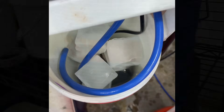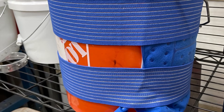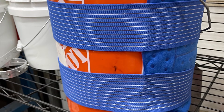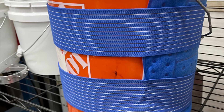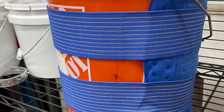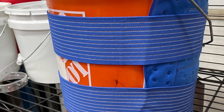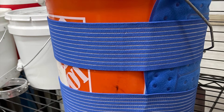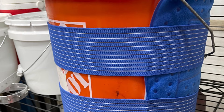Here's what I'm using to cool my anodizing bath. I didn't want to buy a titanium core chiller — they're really expensive and seemed like overkill. So I found this pad that's meant for injuries: you pump cold water through it. I wrapped it around the bucket and pump air to circulate the water inside, constantly bringing fresh acid to the side of the bucket. Even though it's plastic with poor heat conductivity, it still works really well. I have ice water in a small one-gallon cooler with a small pump, and it keeps the temperature within about half a degree.